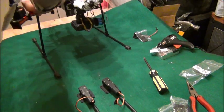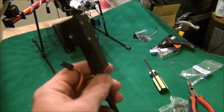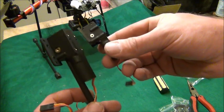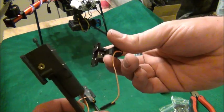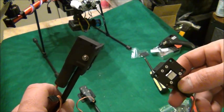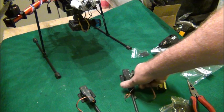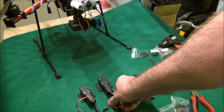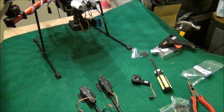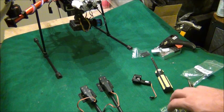Just a quick tip on how to make cheap retracts for your quad or hexacopter. These bigger ones hold four pounds a piece. If you're going with a Phantom, get the smaller ones with three millimeter wire and just bend the wire straight down however you want. I'll paste the links below — it's just a cheap way to make cool retracts for your quad. Set it up on a spare channel with a Y-connector between them both, make sure they're both in the same position when you put them on, and that's about it. If you have any questions please subscribe and hit a thumbs up if you like it — thanks.